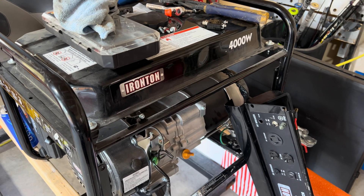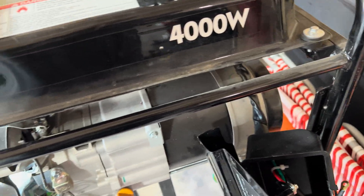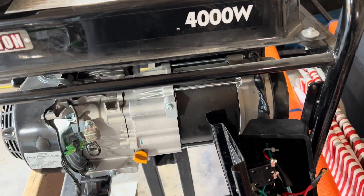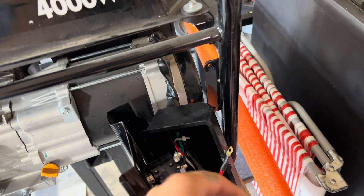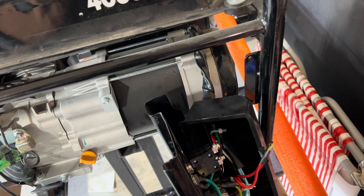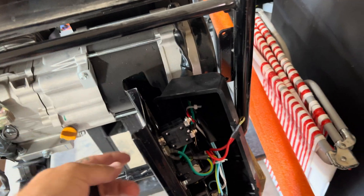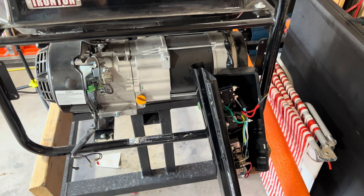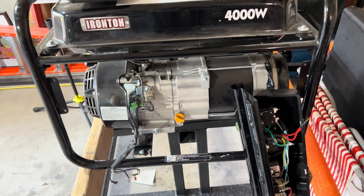It's really simple to do. Pretty much you can pull this all apart — there's like four bolts that hold this. This is pretty standard on about all generators; they're pretty much all really close to the same. Mine has the actual little Phillips screws on the backside. I've got some eyelets, so pretty much these will lay right back on here and I'll tighten them down. These basically just set in place here and you've got a little nut here on the front that holds them in.